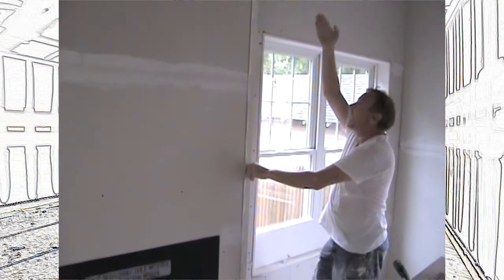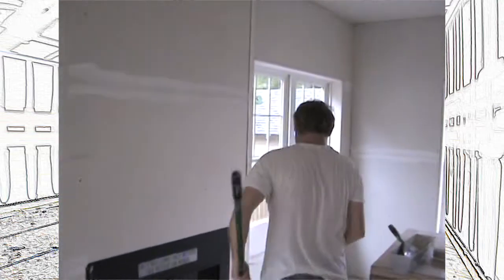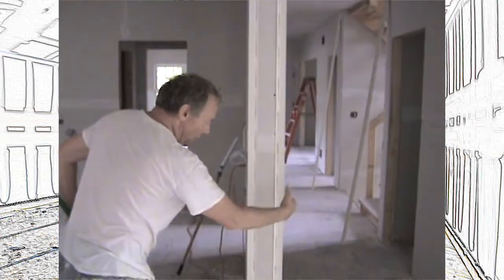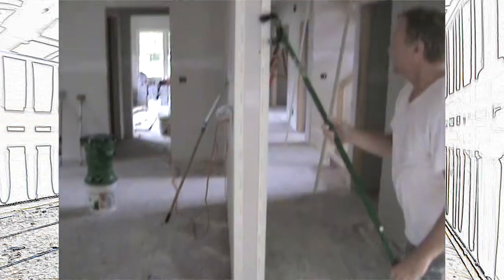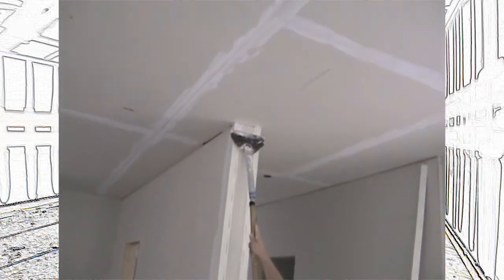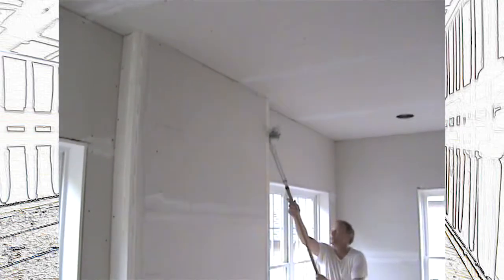Make sure it's straight — eye it up and down, make sure it's nice and straight. Then I have a roller that goes with the hopper, and I just roll it down. Done. I have these two here that I put on. Because this is a return like this, you can't do one side and then the other side — you really need to do both sides at the same time. As I mudded these up, I checked to make sure the hopper was working properly. Now I just take this long knife and I wipe the tops down. Then I just have to worry about the low stuff, which I'll use my low knife with, and I'll wipe those down.